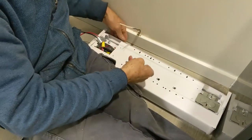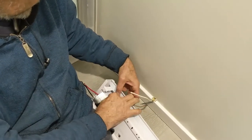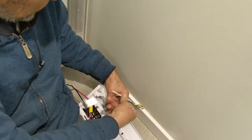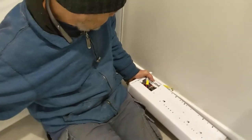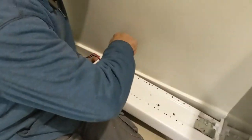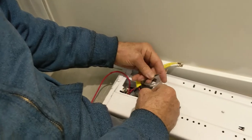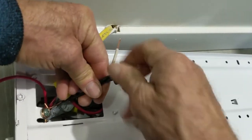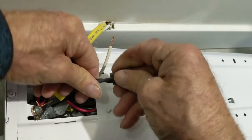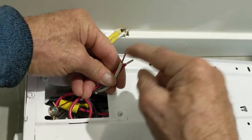The best way to do this: put the heater upside down like that, if that works, do it right, and let's put this guy in — right there, easy. Then grab the wire. Here we go — you have the wires coming from the wall; this is a 12-gauge wire. I just wrap them up a little bit — this one comes from the thermostat, the other one comes from the power. These two wires are 220 — these two legs are hot.